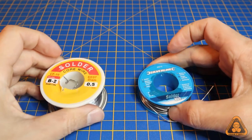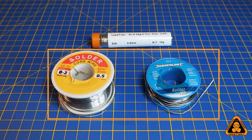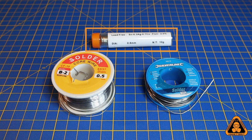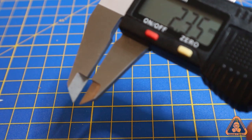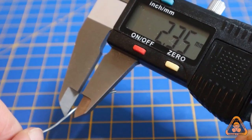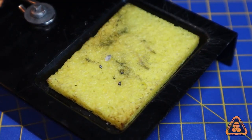When buying more solder wire it can be daunting — some brands are a mixture of lead and tin, which many engineers prefer due to the low melting temperature and shiny finish. Other brands are increasingly lead-free, especially in the EU, with a higher melting point and less shiny finish. Either type will work well. The only personal choice you might have is the gauge — the diameter of the wire. I find 1mm wire is good for most of these purposes.